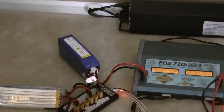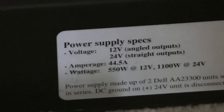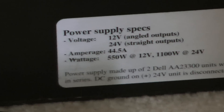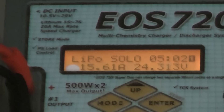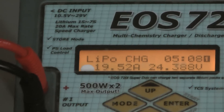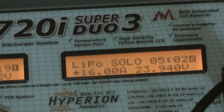All of these batteries are charging fine in parallel. The power supply I'm using is 550 watts at 12 volts, and since I have two units, that's a total of 1100 watts at 24 volts. If you look closely, the first port is giving me 20 amps — the maximum amperage out of this port — and the second port is also showing 20 amps maximum charge, so I'm utilizing the full 20-amp max on each port.